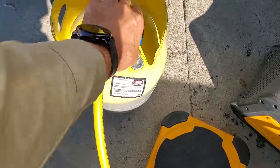We're currently running a pressure test, and we're gonna get started on changing these pulleys and sheaves. When I recovered the charge, the unit had the full charge in it, plus a couple extra ounces, which I had started to add the other day. I've been doing a pressure test for 5 minutes. It's lost 0.2. I'm fine with that. So we're gonna go ahead and finish this thing and pull an evacuation now.